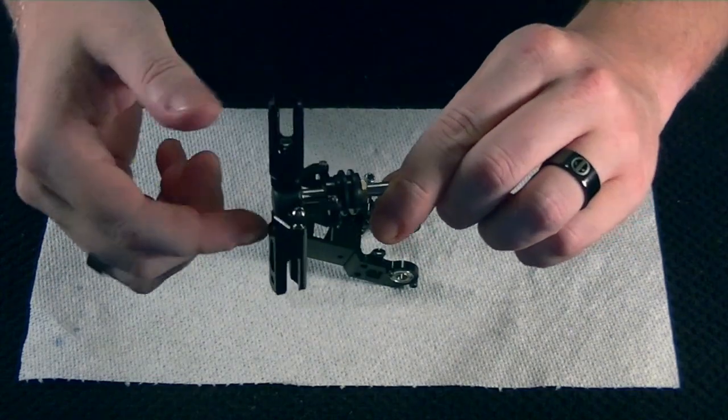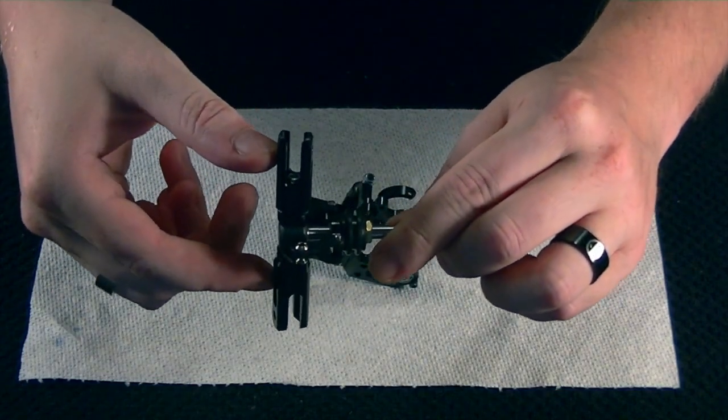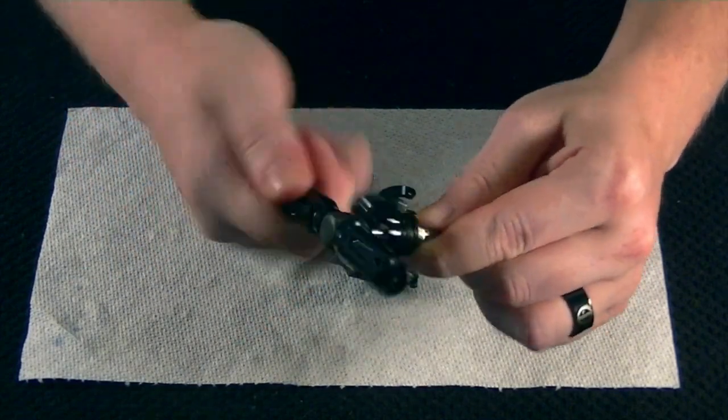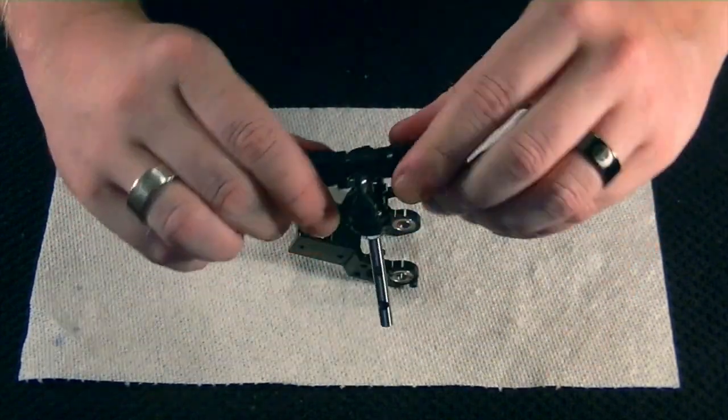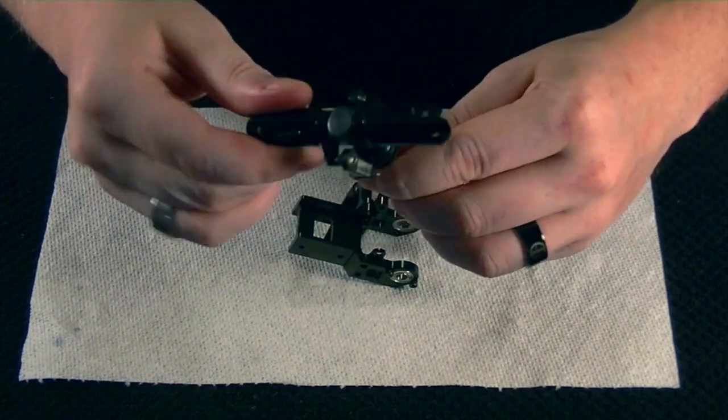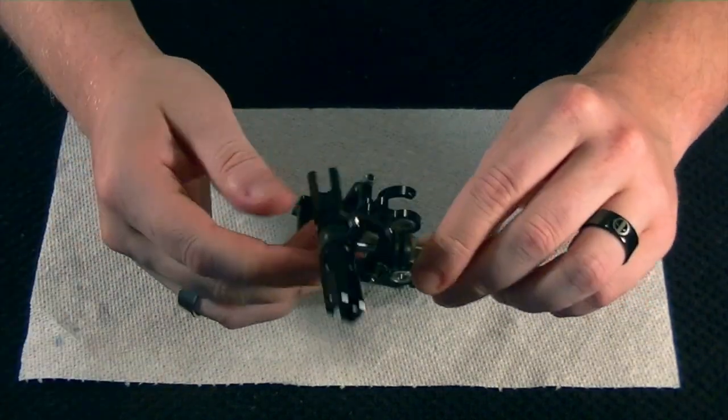And I gave the two 5.5 millimeter nuts a really good wrench down, just to make sure that I'm safe and I don't have to come back and do maintenance later. But I am going to check the tail for preload after a couple of flights, and we'll see if it loosens up at all, but I don't think that it will.